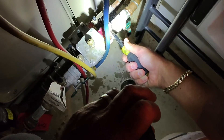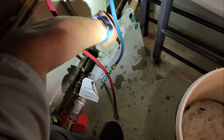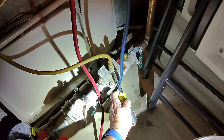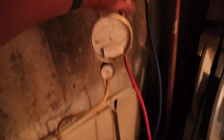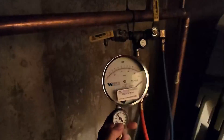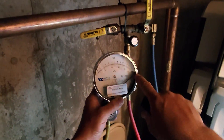We're gonna blow off test ports two, three, and four to remove any debris that may be in the test ports. I'll take my high-pressure hose and connect it to test port number three, then open up test port number three. I'm gonna bleed air through the backflow testing device by opening up A and B through the high-pressure hose to my red hose. Next, I'm gonna close B and make note of my pressure, which is right around 73 PSI. My needle needs to stay pegged on the high side of the test device.